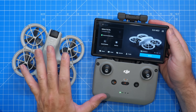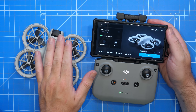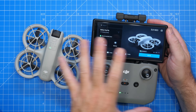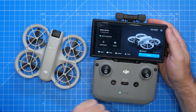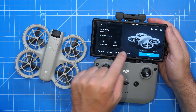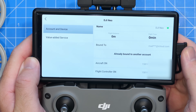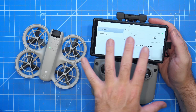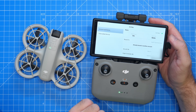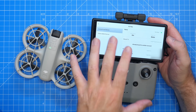If you're in the position where you don't have access to their DJI account, or they say they don't know what it is or they don't have a smartphone, again before leaving with the drone, you should check this with your own DJI account. This time I am logged into the DJI Fly app with my other account — the one that is not bound to this aircraft. If we do the same thing as before, click on Profile, then go under Device Management, you can see this time it says that this drone is already bound to another account. It will give us a hint of what the account name or email address is, but it won't give us the full name or email. Whilst this shows us that it is bound to another account, it will not let you unbind it. There is no way to unbind this drone from this account unless we have the original account holder's login details.